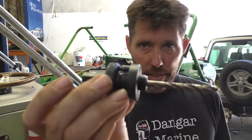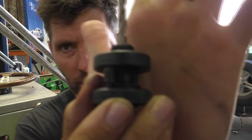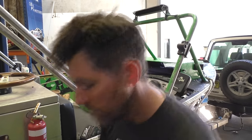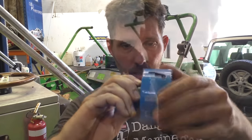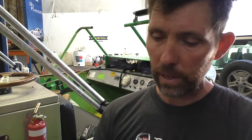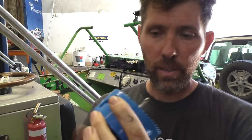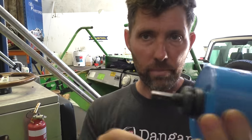For those not familiar with hole saws, they're pretty straightforward. You get a centre section with a regular drill bit in it — there's a grub screw that goes under a flat section on the bit. Then the hole saw of the diameter you want screws on the outside; wind it on completely tight, then back it off until the holes and pins line up, turn the bottom collar so the pins come through and it can't rotate anymore. Pop the drill in and you're good to go.